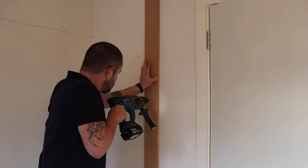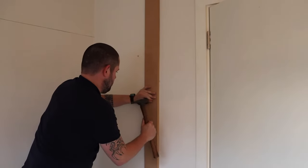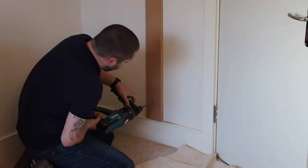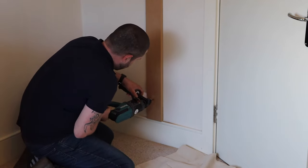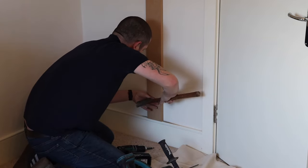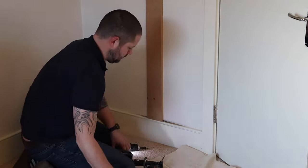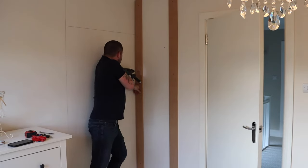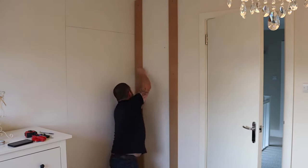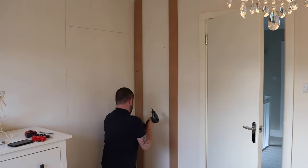There we have it. I'm going to start off by putting these two strips down the wall — there's going to be one down the back as well. What they're primarily for is just to get over that skirting board there, just to pack it off. It's going to act like a little filler strip to pack the wardrobe off — one at the front, one at the back so it's even. When you do this you want to check that your walls are actually square into this corner, because if they're not you'll want to change these accordingly. Do three fixings top and bottom, and then I screw through again with the side panel which you'll see in a minute.